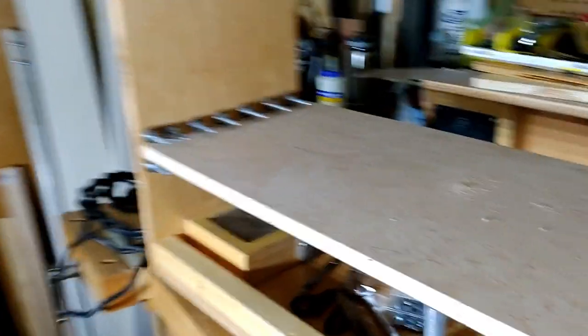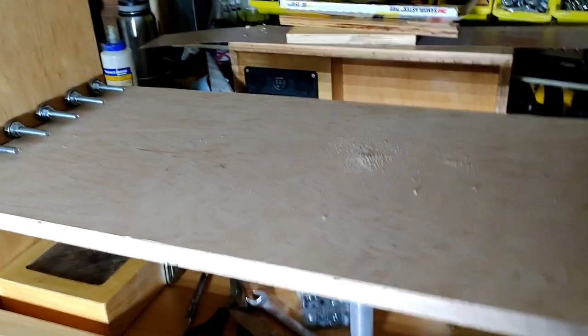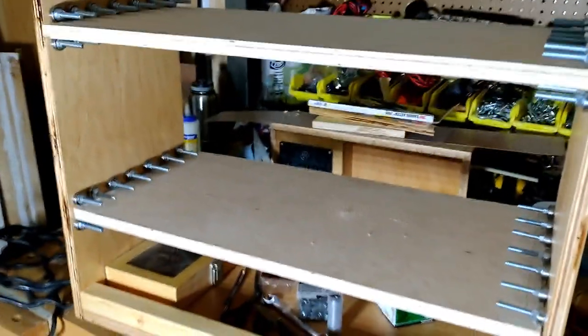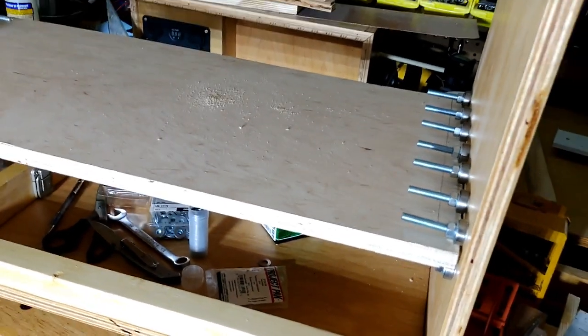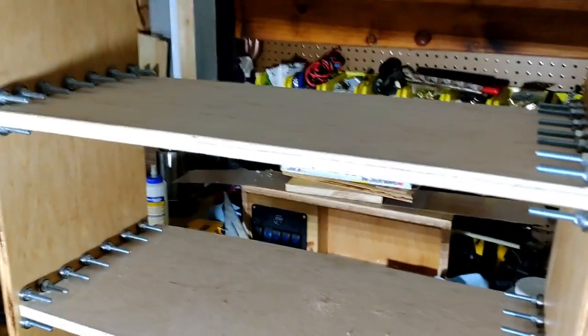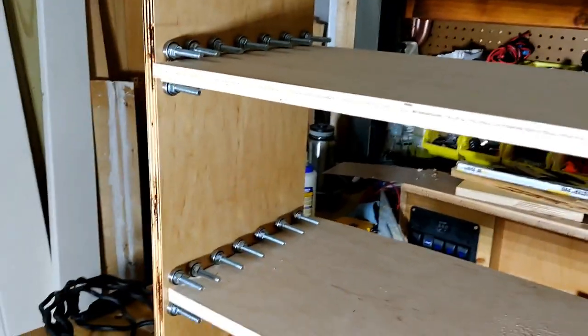The top row is a little tighter but also rolls in and out really well. I'll fill in all the holes with wood putty and set these up so that, whatever size the battery is, you can tighten it down with a couple of straps. I'll cut off all the excess bolt ends with a cutter, grind them down, and then put in the remaining pieces of wood. I'll also drill a hole through the top tray down into the bottom to run cables between the batteries, which will be wired in parallel.